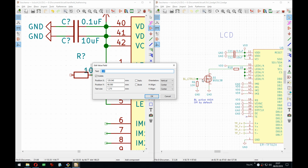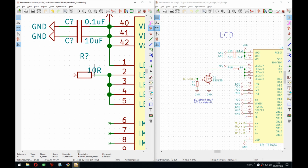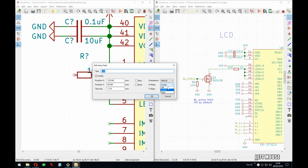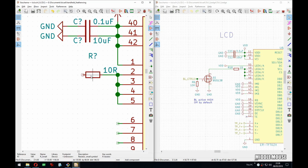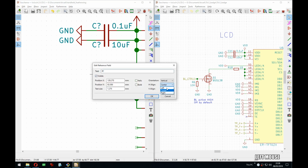Oh, actually, that's another thing. Do I need a pin for this? Yeah, I'm just thinking because this pin should go to the Feather again, but the Feather will run out of pins before I can connect everything. So, let's see. But it's really bright, and if you don't PWM, you just pull it high here, you're just blinded. So I put this here so you can have just a bit less by default. And 10 seems to work quite alright. It helps a bit. You can do like 20 or 100 even. Depends what you want as your default.